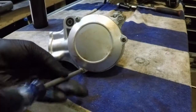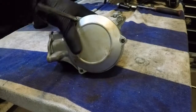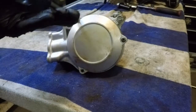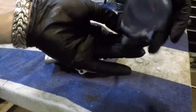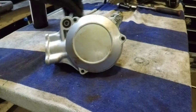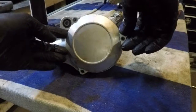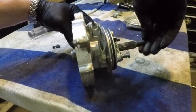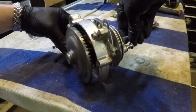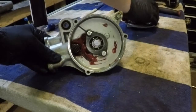This is accomplished by removing these three screws — one, two, three — with a number three Phillips. These are not number two sized Phillips drive screws. We've got the three screws off. Cover lifts right away. And then the ring gear comes out away from the pinion gear just by pressing the axle shaft out. Set that off to the side.